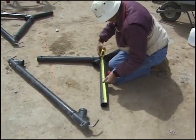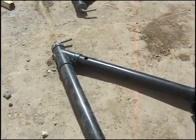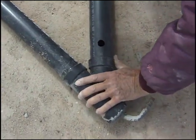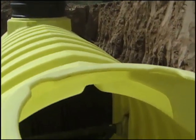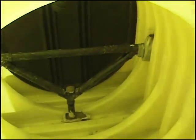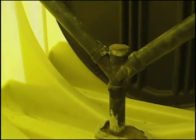AL is constructing three triangular cross braces that will be used to reinforce the cistern walls. Polypropylene tanks are not engineered to go dry. Since a cistern may drain down to near empty between storms, a situation could occur where the tank sides could bow inward from the force of the dirt around it. The braces, which are made out of plastic sewer pipe, should give adequate support with the type of soil found on this property. Putting in a little extra work up front to prevent problems down the road is always time well invested.